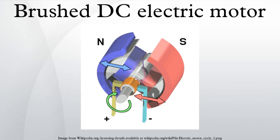Torque and speed characteristics, shunt wound motor. With the shunt wound motor's high resistance field winding connected in parallel with the armature, Vm, Rm and A are constant such that the no-load to full load speed regulation is seldom more than 5%. Speed control is achieved three ways: varying the field voltage, field weakening, and variable resistance in the field circuit.